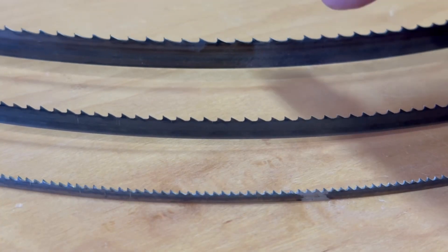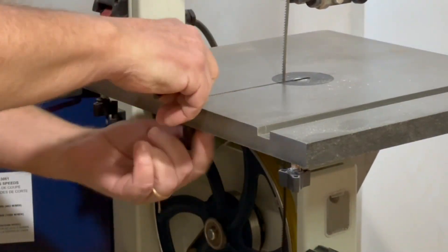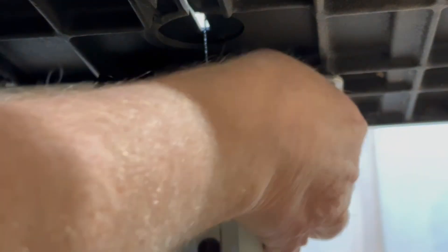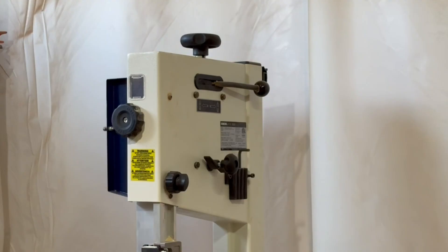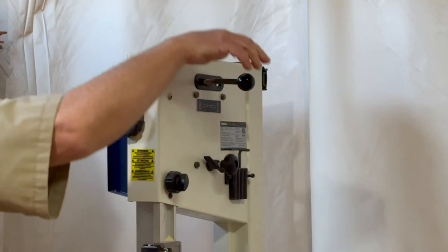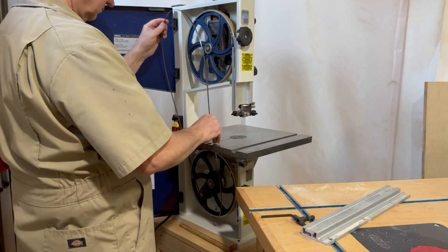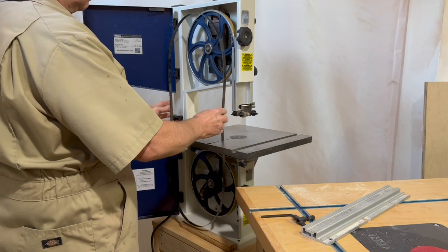I'll leave links in the description to the other blades I use that fit this bandsaw. The ability to easily change the blade is important to me, because if it's too difficult I'll get lazy, won't do it, and end up using the wrong blade for the wrong cut. To replace a blade, I start by taking the fence rail off and then removing the table leveling screw. Then I loosen and move the blade guides away from the blade — both upper and lower. I really like these cabinet door latches with their elliptical design. Then I just release the tension on the blade with the quick release lever and pull the blade off the top wheel, or back off the tensioning knob a little if needed. Then I thread the blade out and off the bottom wheel. Note that I probably should have been wearing gloves, because these teeth are pretty sharp.